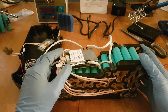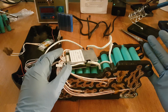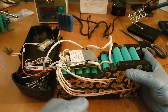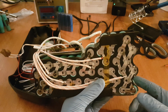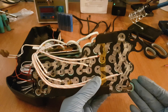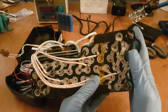In my situation I got a little bit from all of these. First, I dropped the battery accidentally and got the symptoms — I could not use all the capacity, and after a while the BMS died so I could not charge it at all. Technically, one of the cells on the corner got short circuited, which killed all the cells in that parallel group, and then the BMS died trying to balance those already dead cells.